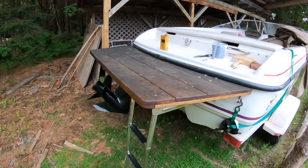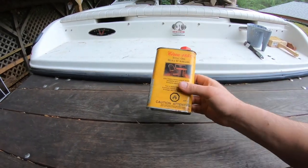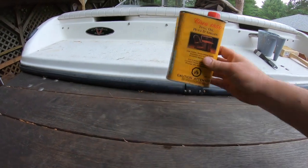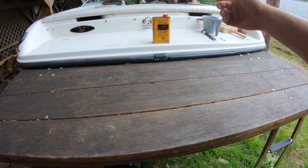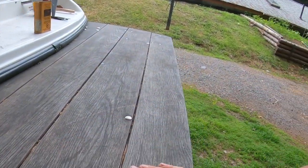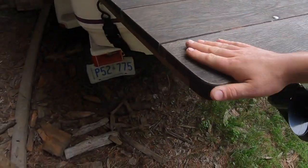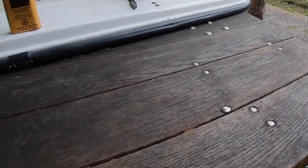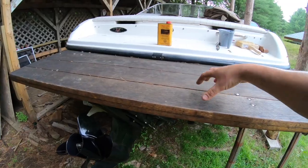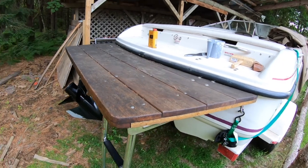To keep the wood protected, you've got to keep it from drying out. What I do every single year is soak it in tung oil. The tung oil I use is made by Circa 1850 — I get it at Home Hardware here in Canada. It does a real good job at keeping the wood protected. It's an oil, so it absorbs into the wood. I didn't want any sealant that seals off the wood, because if it ever breaks down and water gets behind it, there's no way for that water to dry. The oil keeps water out naturally and also gives a nice finish.